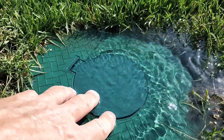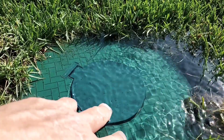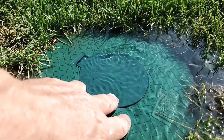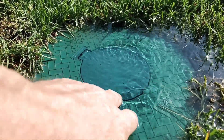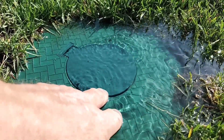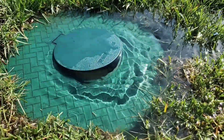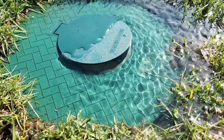The key is the height at which you set the pop-up emitter. If the pop-up emitter is left too high, you will chop the lid off. You want to have your pop-up emitter below all the turf grass blades. You want the water to flood the turf restrictor plate and then soak away into the grass.